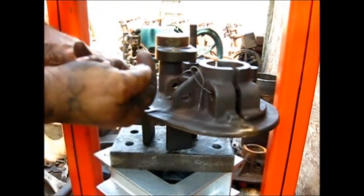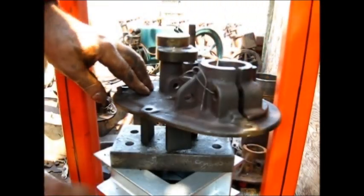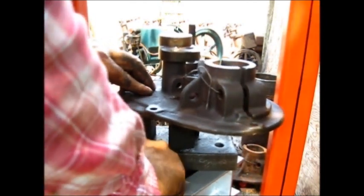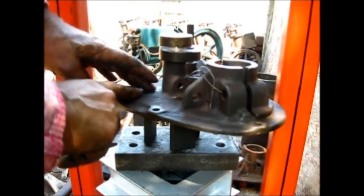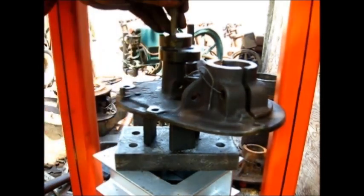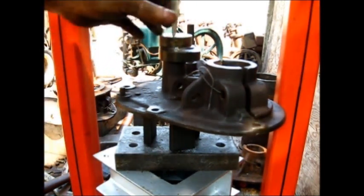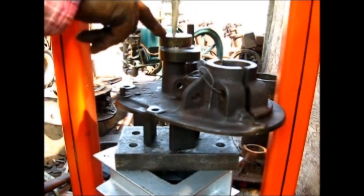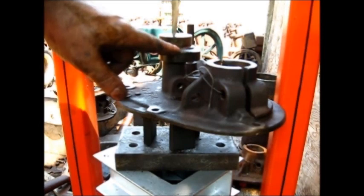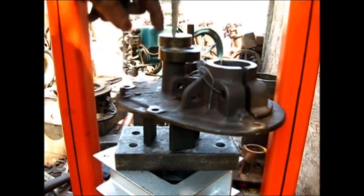The stand-offs come through the gear and are resting onto the housing. The center of this shaft should be at the center of your ram. This one I'm just using the lever mechanism — never underestimate the power of a lever. I mean, you can move a railroad car with a lever. You put that right there, raise that up to where it's in a straight line and you've got plenty of clearance on the hole. Now all I'm going to do is put leverage on the lever and we'll observe this gear being pushed away.